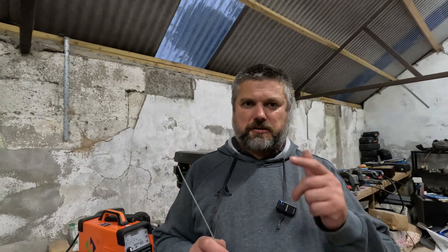It didn't turn out too bad — quite happy with the strength. Now, there are a few things I did find along the way. Aluminium is very, very sensitive to heat. Once it starts heating up, it'll just stay hot and keep heating up, and what you end up with is just a blob. I've had a couple of burn-throughs where the whole thing just went. So I had to grind it back and start again. I found you're better doing a wee bit and then going over it again quickly. There is a foot pedal — I just haven't mastered that yet — where you start off high amps and then lower it once you've got the thing going.